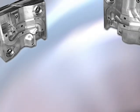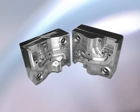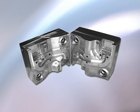Here are some examples of nitriding workpieces. A hydroforming tool made from cold work steel for the production of steel tubes. The objective of the treatment is to increase wear protection of the tube section when placed and formed inside the tool.